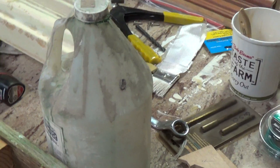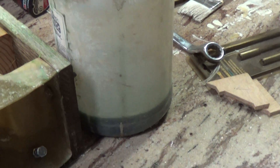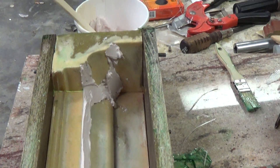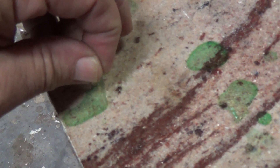There's another company called Part-All — P-A-R-T-A-L-L — it's a green substance, alcohol and some sort of plastic. What it does is when you paint it on with a brush and tip it up to let the excess run out, it gives you a real thin covering — a membrane. I'll peel some up off the table here and you can see it's a thin plastic membrane. You don't want your part sticking to your mold — that's not fun.